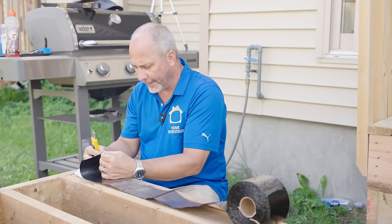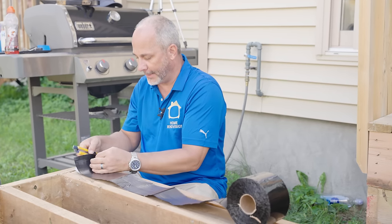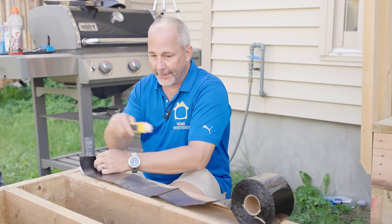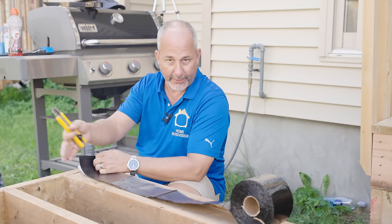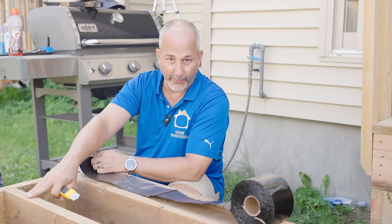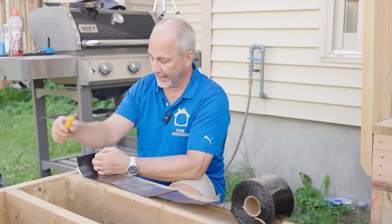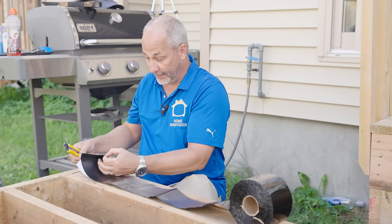If you're in an area where you have a lot of trees, it becomes a little bit different. Now it becomes real vital, right? Because if you're not gonna take the time to pressure wash all of the needles and the leaves out of the joints, that trapped organics when it gets wet really rots. And once you have rotten wood up against fresh wood, the fresh wood starts to rot. So if you don't keep your deck clean, yeah, joist tape.